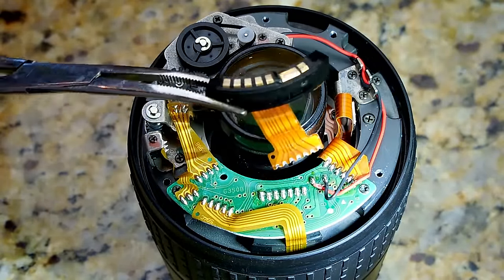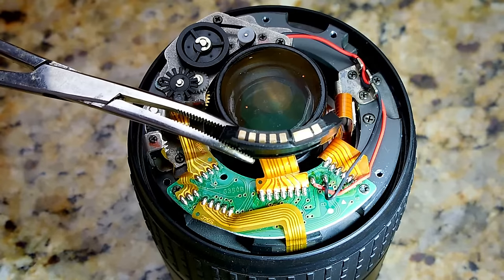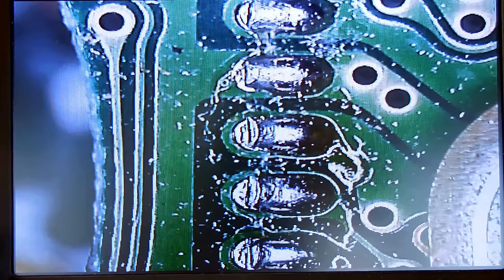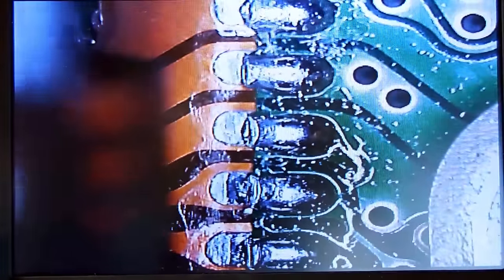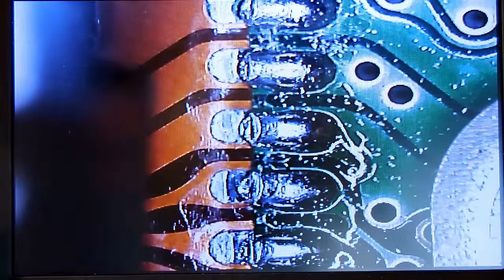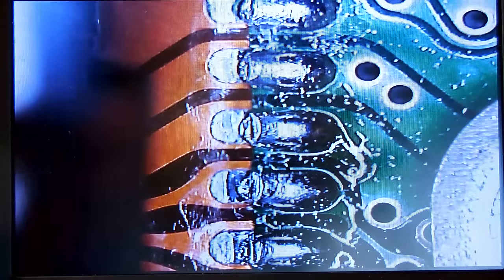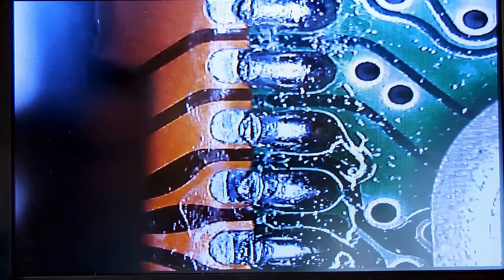Alright, the problem is right over here — this flat cable came off right there. So I'm going to have to line everything up under magnification and solder it back. While I'm doing this, you'll be looking at the monitor. Keep in mind it's much sharper if you looked at the monitor directly than what you're seeing on the video player right now. I'm now going to position it where it's supposed to be — and that looks pretty good. I'm going to take a little bit of the reflow paste and apply just a small dab to the end pin first, then do the opposite end. Once the two ends are done, the ribbon will no longer be able to move and I can solder the remaining pins in the center.